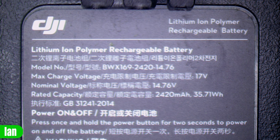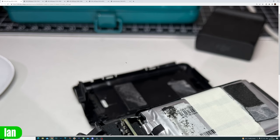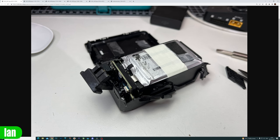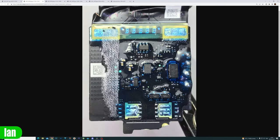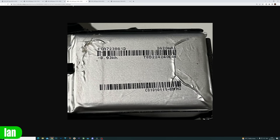There has been some investigation done on this as well. One of the users on the fpv.wtf Discord, ficheck, actually tore a battery down because he had one that crashed, and he's kindly shared images on the website. You can see the battery with the lid off, images of the internal PCBs with the FETs and the control circuit, and then an image of the actual cells. It does appear to be a normal traditional LiPo like DJI use in all of their other drones, and there's no reason to believe this is just a standard lithium ion battery as the DJI website suggests.